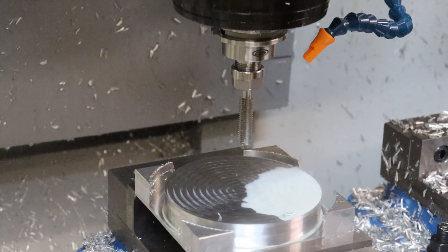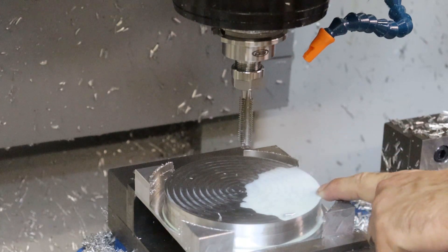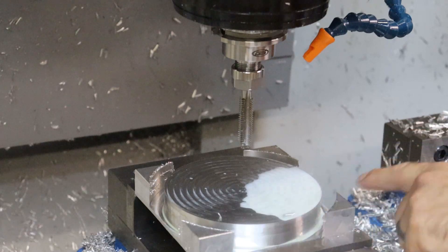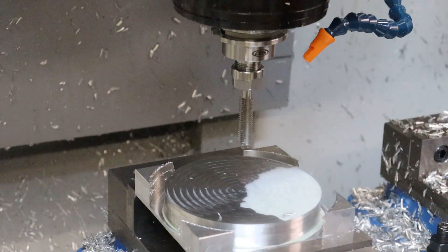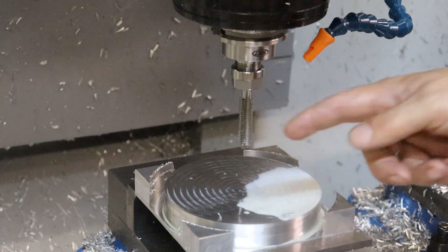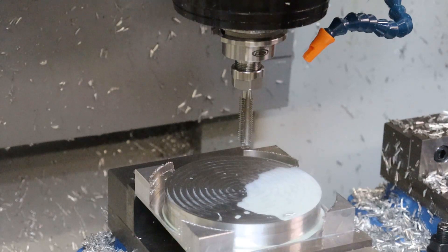Alright, we've got all our tools set. We are ready to drill and ream all of our back holes and then make our two mounting holes for this core insert - we're looking at the back of the core. When we're done with all this, we're going to bandsaw out the corners and then stick this on the lathe to do the profiling of the core itself, and then cut the runners to connect with the reamed holes that are going to have ejectors for the tunneling gate runner.